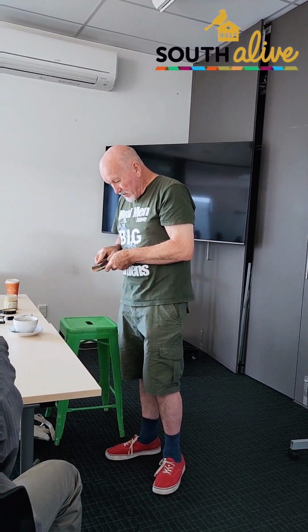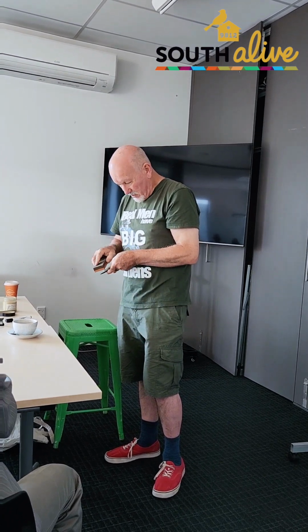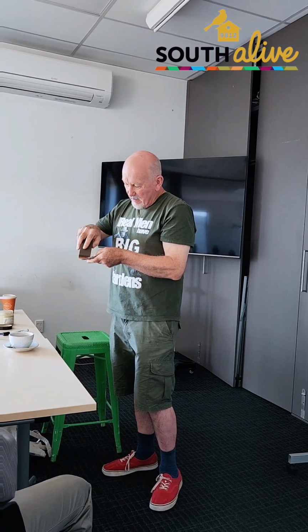All right? And it is as simple as just giving it a rub. With a little bit of practice, you'll be able to work out what angle it is. Because if you're doing this and it's not getting sharp, you probably don't have enough angle on it. Somewhere around a 45-degree angle is okay. If you get too steep, then it doesn't cut as well. Sorry, 30-degree angle, not a 45.